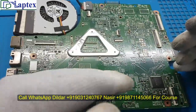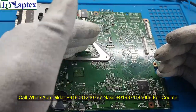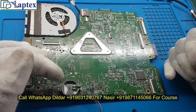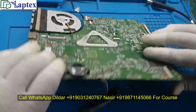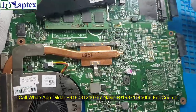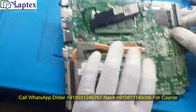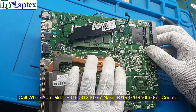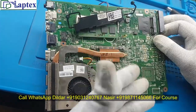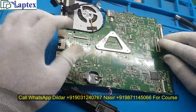For example, if the VS supply is missing in the motherboard — if the voltage does not transmit from S5 state to S0 state — it will produce seven beep sound. If the BIOS communication is not proper with the PCH, it will produce seven beep sound. If some of the required supply for the PCH does not meet its requirement, it will also produce the beep sound.